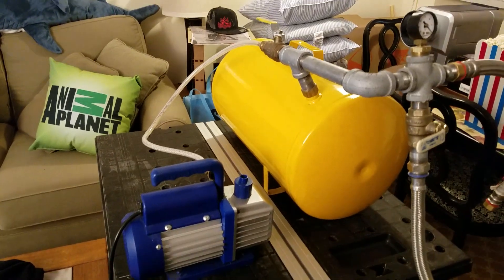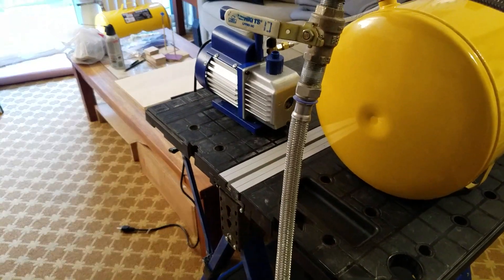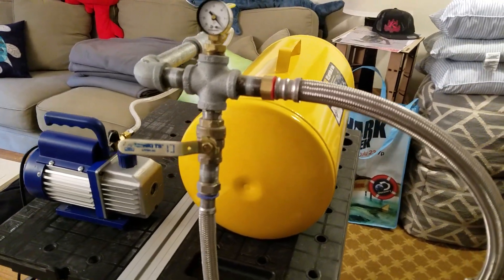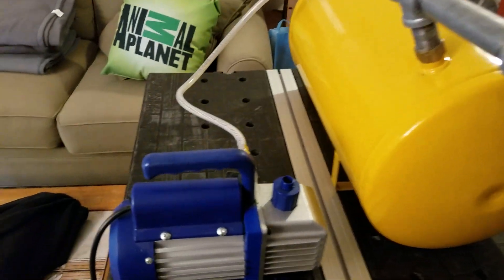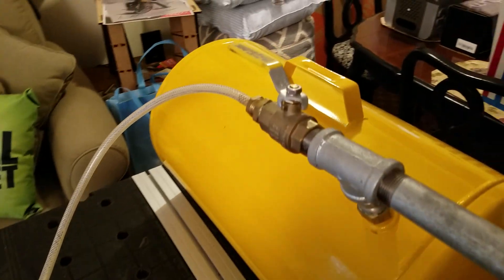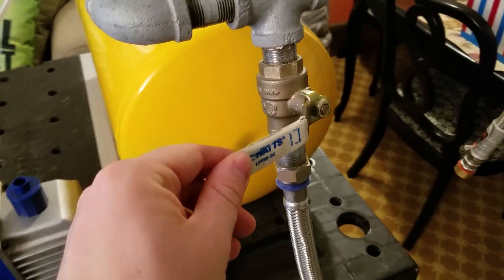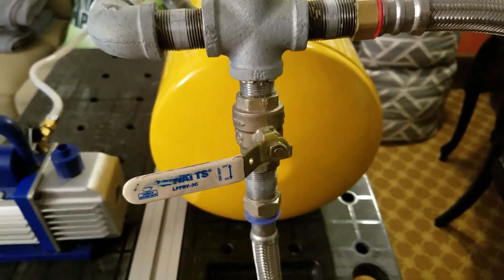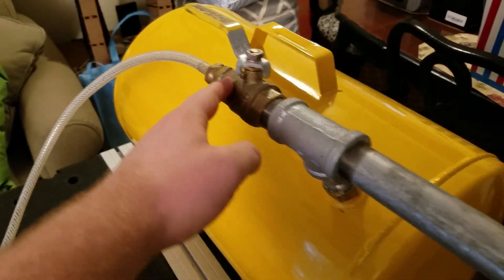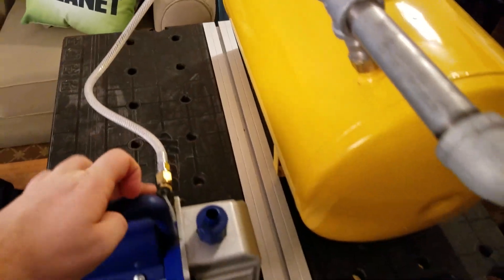The basic workflow is this bottom hose here will go to the bottom of the platen. This hose here is just another one that goes to another air tank to put these two air tanks in parallel with one another. What I do is I turn on the vacuum pump, making sure that this valve is in the open state, which it is right now, and this valve leading to my platen is in the closed state. This makes sure it's not sucking air through from the bottom of the platen, basically ruining your vacuum. And this one is open, obviously, to allow the air that's currently in here to be evacuated through the system and out.